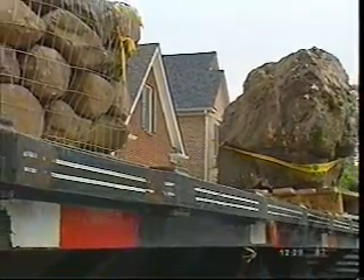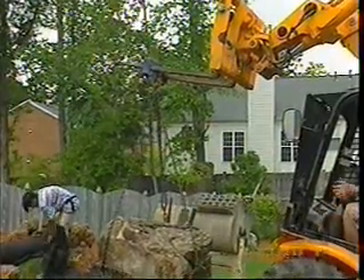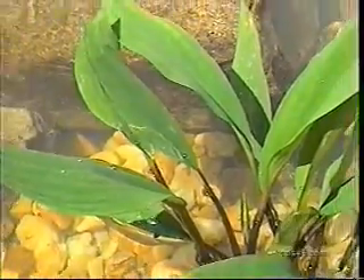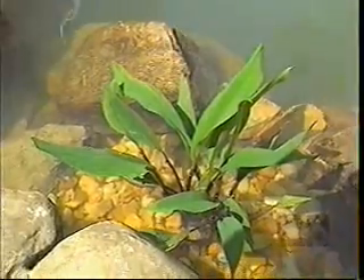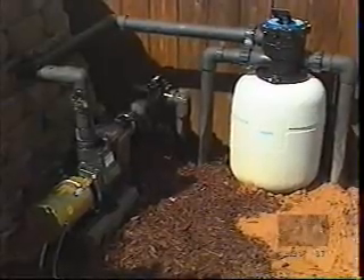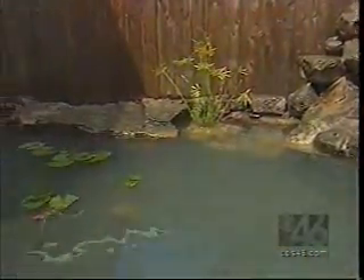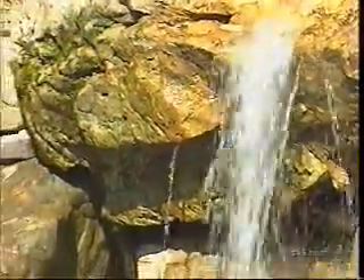The larger boulders, weighing anywhere from 15 to 2,500 pounds, are set in place with the help of a forklift. On day three, the smaller boulders are put in place. As this is done, planter pockets are created where aquatic plants will later go. All the boulders, large and small, are then mortared in. On day four, the pond pump is fully connected, the underwater lighting is set in place, and the pond is filled with water. The pond then sits for 48 hours. On day seven — the fifth work day — the water is tested for safety and then drained.